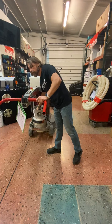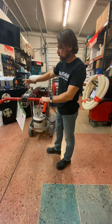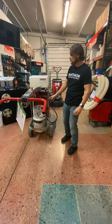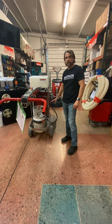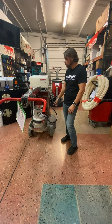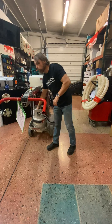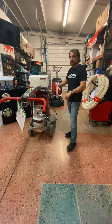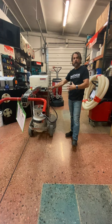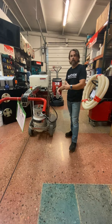At the end of the job, I always recommend bleeding out any propane. One of the reasons why a lot of these machines will not start the next day is because you just turned the tank off and shut the machine off. You actually want to turn the tank off while it's running and let the machine die at the end of the day. That will get that propane out of the regulator. Then next day you open it back up — voilà, it'll start right back up.